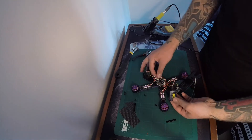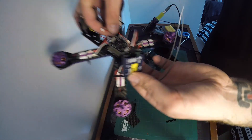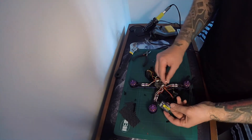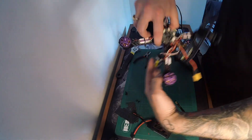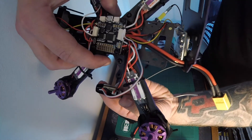What we now need to do is next to the power cable there is a little clip — that's your battery telemetry port. We're just going to put the new cable we've soldered on into there. Once this board is down, I'll bring you back and show you how to connect your battery cable. Quick recap of what we've done: we removed the flight controller, attached the battery telemetry cable to the power line on the PDB, put the flight controller back on and screwed it down, and removed the cable from PPM to iBus and connected it to the receiver.